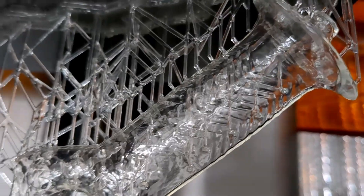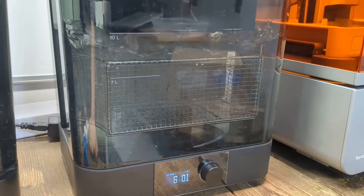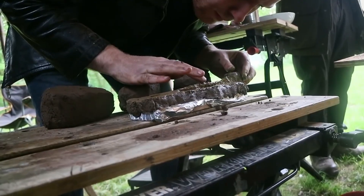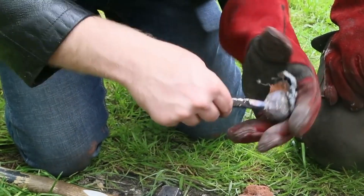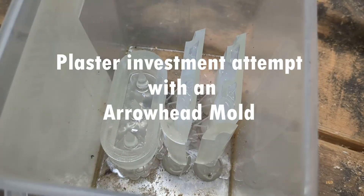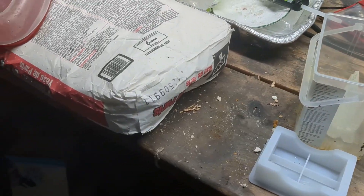The next problem is figuring out how to turn this into bronze. Formlabs sent me a lot of tools, but one of the things they did not send me was a kiln or the investment material. I want to try doing this part primitively — I now have a repeatable wax part, so I can play with primitive methods. While with Will Lord, we learned about using raw clay as investment material with mixed success. I later switched to Plaster of Paris because my clay started cracking. The pieces have been glued in with hot glue into a plastic tub and now we're adding the plaster and sand mix.